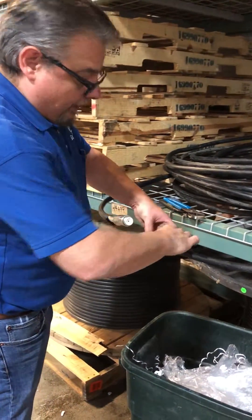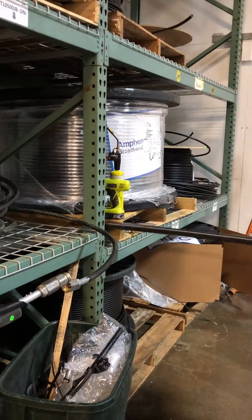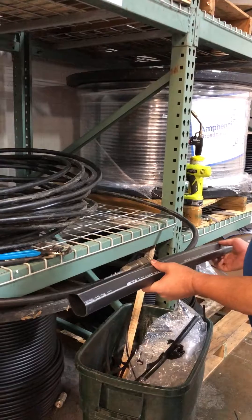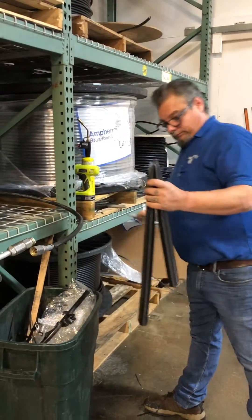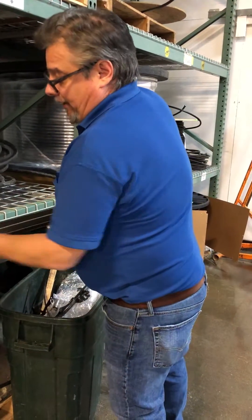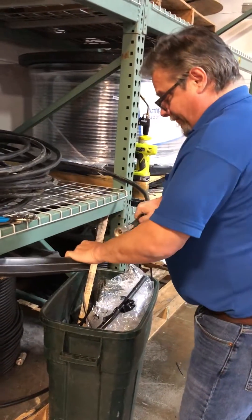This is for an underground repair. If this was aerial, these are outside-rated connectors with O-rings, considered waterproof — but they're not considered waterproof for underground. What you want is a good 12 inches of shrink beyond your bare cable. In this case it's about a half a stick of shrink tube, a little more than half. The most common mistake — I can't tell you how many times I've done it — is forgetting to put the shrink tube on before putting the connectors together, then having to take it all apart. So if you can remember it ahead of time, it's very helpful.